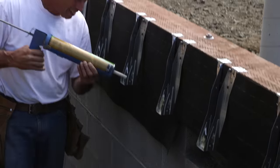exactly the same way. If you are careful and put these things in flat, if your bearing conditions like these hangers are uniform and well secured, it's very unlikely that you're going to have any kind of a squeak. But squeaks do happen. Some squeaks can be found. Some squeaks can be silenced, but if squeaking is a hill to die on for you, there is one floor system that will never squeak, and it's called concrete.